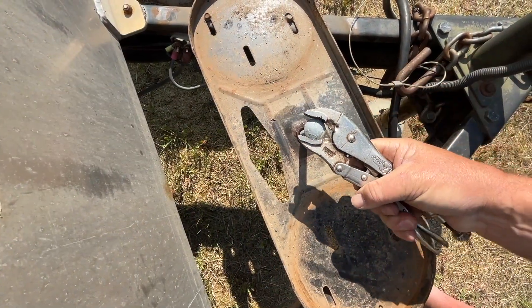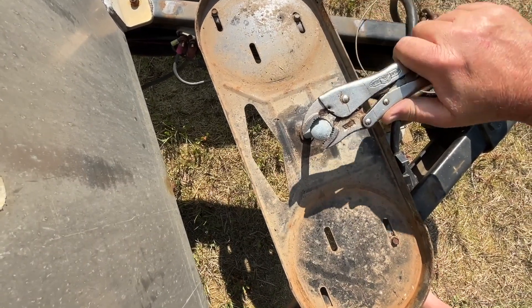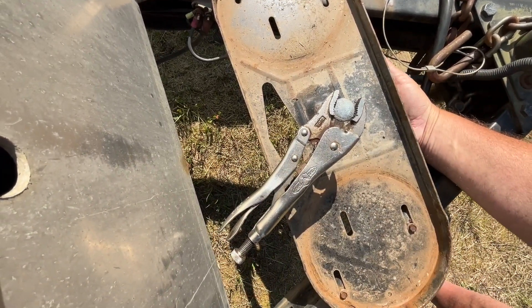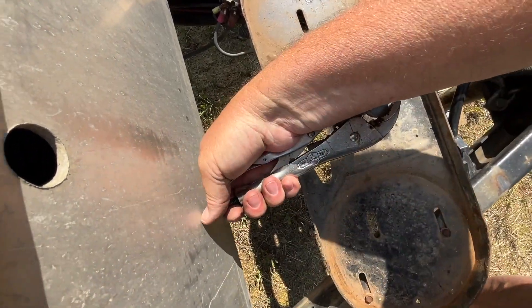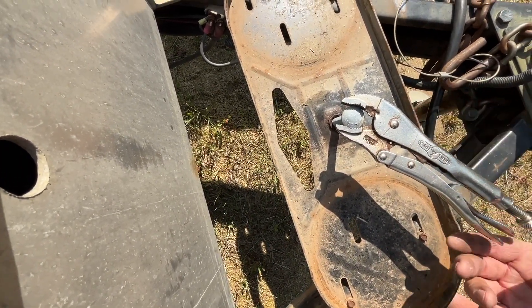I got lucky — I found an old carriage bolt that is the same size and thread pitch as the rod I'm straightening out. I'll heat it up again, not the nut this time but the surrounding area, because that's what has to move. If I damage the bolt, that's fine — I've got four of them sitting in the shop for at least 20 years. I just have to make sure I tighten this bolt far enough down into the nut so that it protrudes through the bottom and I don't damage the threads. Okay, I can feel that going through the bottom now.